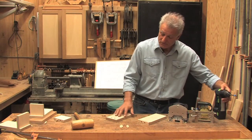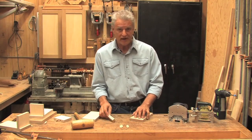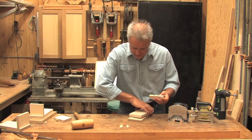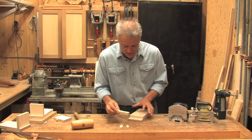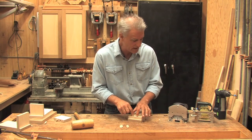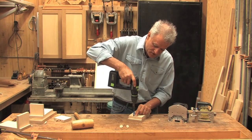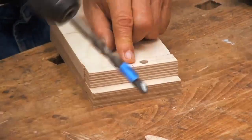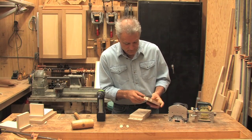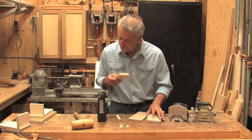The last joiner option which I'd like to show you is the dowel. Now, I'm using 3/8 dowels here, and with this little jig which I've made, this allows me to position the jig right over the hole that I need to drill out. And if I've clamped this fairly securely, I'm able then to drill it out using this jig as a guide. Also, it will allow me to drill from the end as well and put the dowel right where I need it.